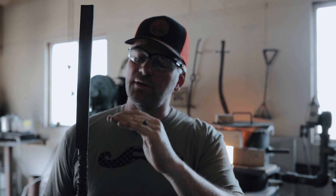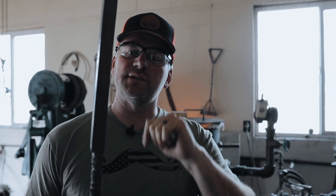We've got this bar fitted up and ready to go into my twister. From about here down to here I'm going to knock the corners off in my press and make that bar round — not perfectly round, just knock those corners off. I found that helps when I forge weld it down at the end into a bar; we get less cracking and fewer problems with little seams wanting to travel through the blade.